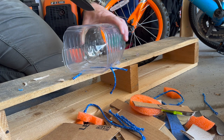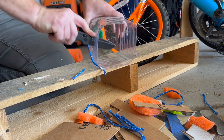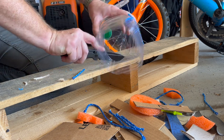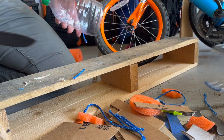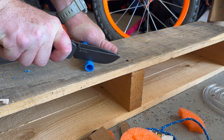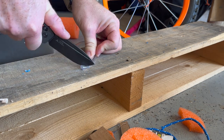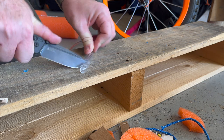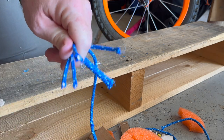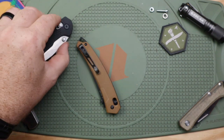The tip is very blunt — this is not a piercing blade at all. You'll have a little trouble piercing packaging; it can be done but it's tricky. It's on an eighth-of-an-inch thick blade, 0.12 inches, tapering slowly to the tip, so you've got pretty good robustness. The steel is 10Cr15MoV, which apparently molecularly is the same as VG10 — so this is essentially Chinese VG10.